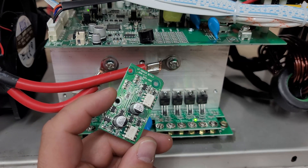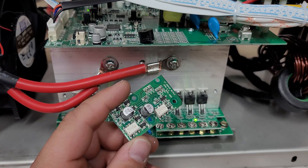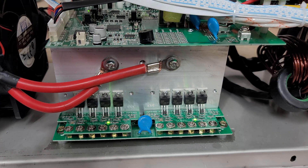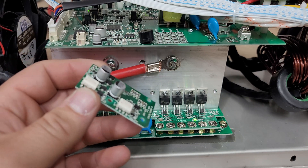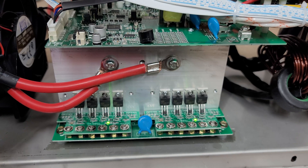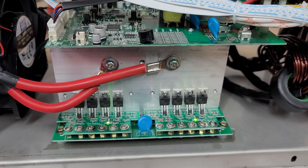So A through F — and it turns out E lets you know about the driver board. What's funny is that those voice prompts don't even line up to the new boards anymore, because they are now a single board rather than modular like the old setup. The only thing you can replace is this driver board. We'll plug the driver board back in and power it back on — driver board installed and here we go.